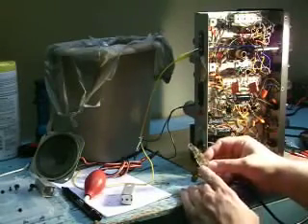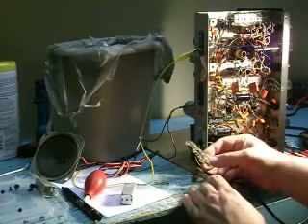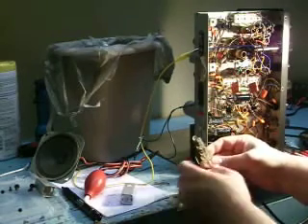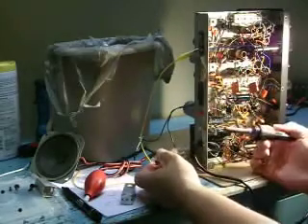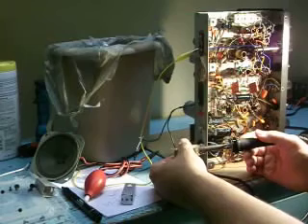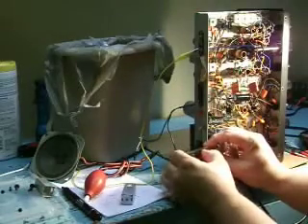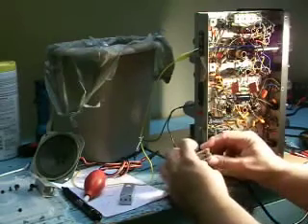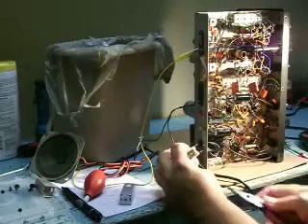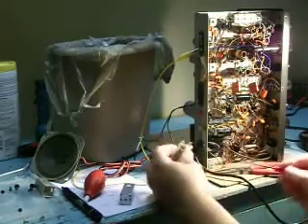I tried a few test subjects. First I tried drilling out the rivet — it was going really smooth until the drill bit caught and it separated the bottom from the top, ripping all four wires off. Now I have lots of spares from radios — I've been collecting parts for almost 40 years. So I found the best way to do this. Make sure you're in a ventilated room because I don't know what these fumes do — do it at your own risk. The best way is to insert a soldering iron into that rivet, heat it up a bit, and push it down. What happens is you loosen the wafer. And then you can either heat it up and push it down more, or I just start carefully breaking the plastic out. Keep in mind there are tiny little wires along the side — very easy to break.